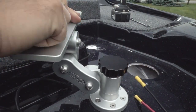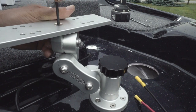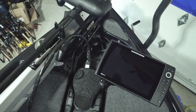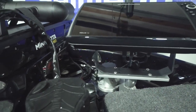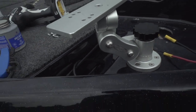Once the base is secure, figure out how you're going to mount the Extreme Mount. For me, I'm turning it at an angle so I can have the graph off to the right of my foot on the trolling motor pedal but facing me. I want a downward angle on that graph because I'm running Humminbird Mega 360 on this boat and I need that big 12-inch showing me everything I need to see without interference from the sun or wrong angle.